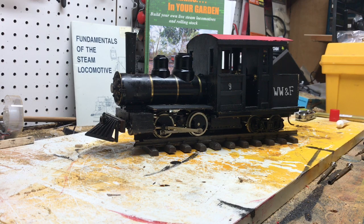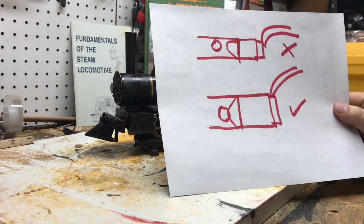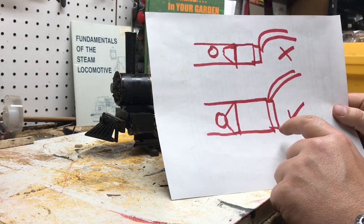And then I sat here and I stared at it for a little bit, and I said, wait a minute, that's not a jet in a burner. That nozzle is a carburetor. And when I thought about the issue as a carburetor, what I was doing was I was running this way too lean.